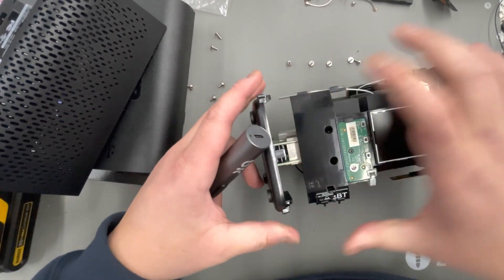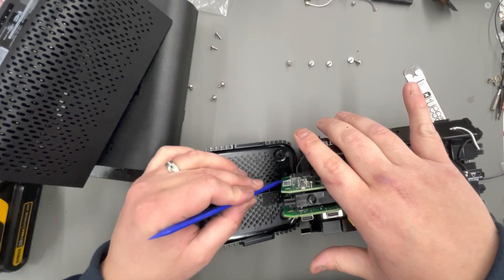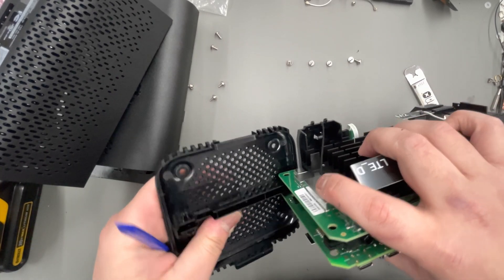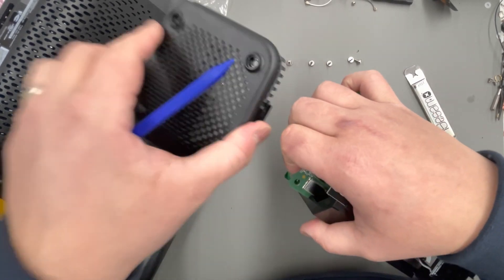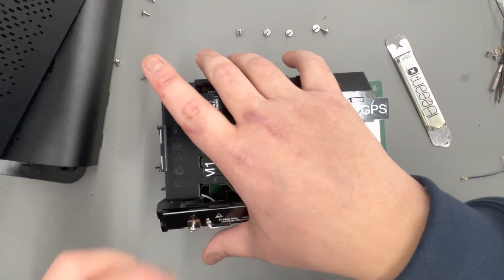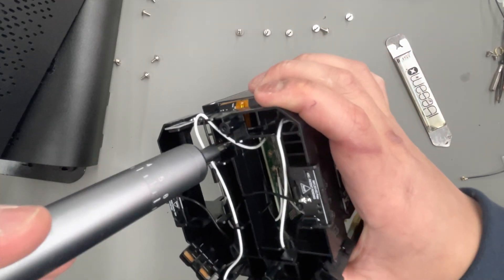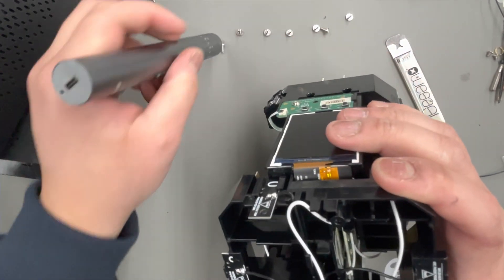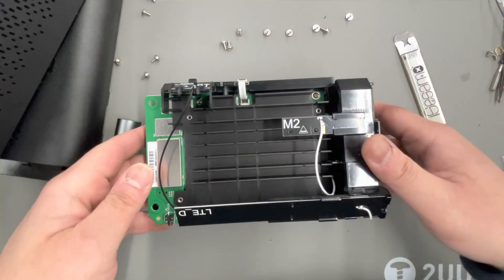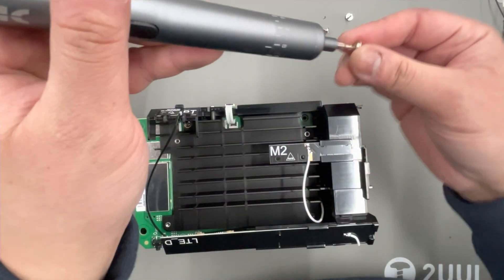The goal is to remove the top pieces because they take up way too much space. I'm trying to extract the board so that all I have left is the two boards, the top and bottom, and the two large heat sinks — which will give me plenty of clearance to install it into the outdoor enclosure. Everything is a sandwich board, so to remove the top and bottom pieces you just have to create a little bit of separation by continuously removing the rest of the screws.